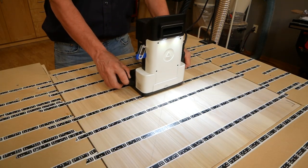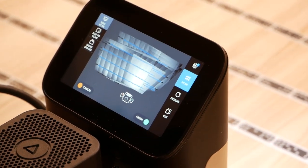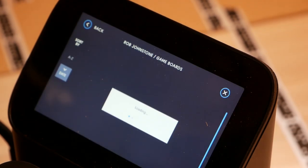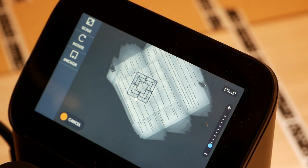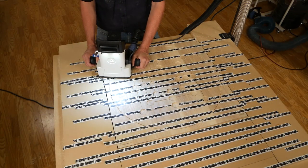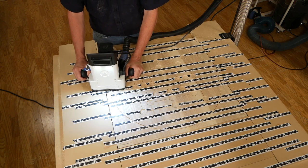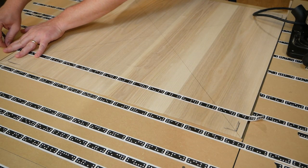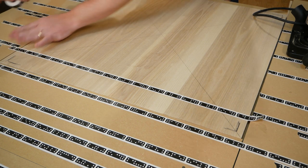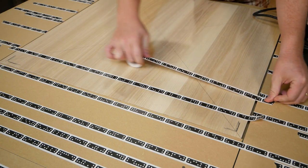I'm scanning the workspace, which tells the Shaper where it is in relationship to the tape. Next, I import the cutting program and get ready to cut. I created a fixture with MDF so that I can make all three game boards in the same manner. The tape remains on the fixture so that when I slide a new tabletop piece in, all I have to do is put the tape on that surface — it's very handy.